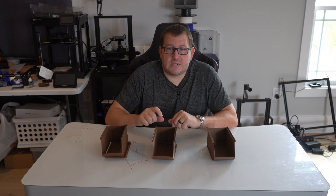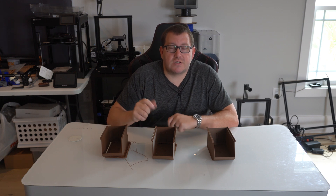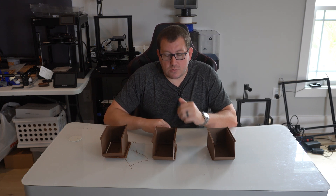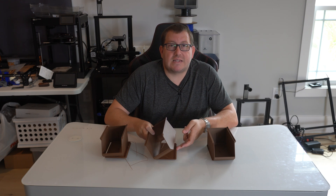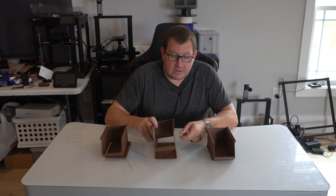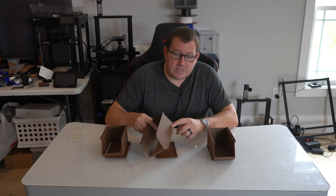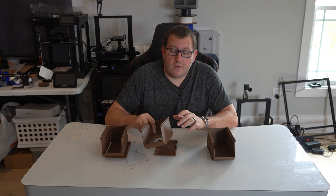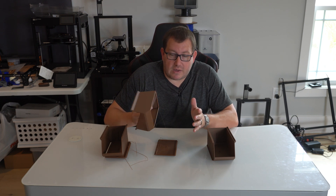If you were to print smaller pieces — I printed a chest piece right after this and had no issues because it was small and only a couple inches tall — there was no layer separation. It has to do with speed and temperature. The bottom layers ended up working fine because the heat from the build plate helps soften the material coming out of the extruder. But you get to a point where that heat goes away and it starts to under-extrude for a while. Most of the time it ends up fixing itself — the rest of this print ended up looking fine. Though I have seen examples where it comes back later up in the print as well.